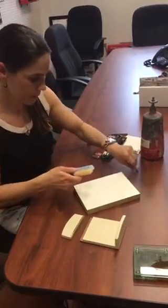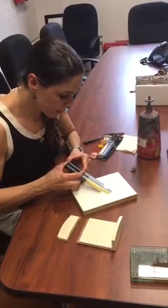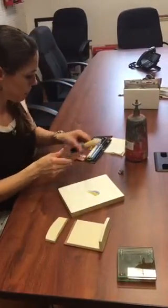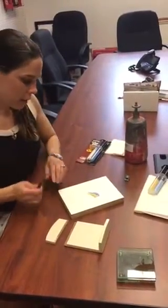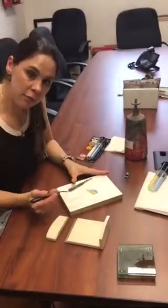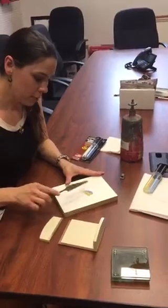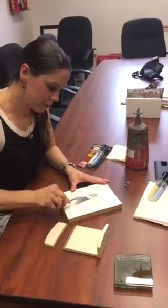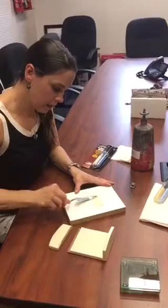Take the tip off — there are two sides, the blue and the yellow. I'm going to depress the plunger and mix out a little bit, then back off the plunger to stop the flow. Put this on a paper towel. The best thing to do is use some kind of little putty knife on a flat surface to mix this up. The neat thing about Super Epoxy is you know it's fully mixed when the blue disappears.